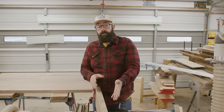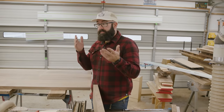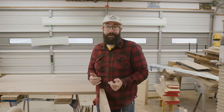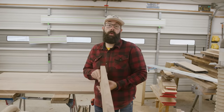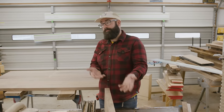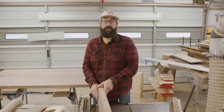This is something you need to factor in when you're designing your pieces and when you're ordering your material. I mean, we had 7 pieces of wood, and one of them went bad. So that's 1 in every 7 pieces of wood on average for this project have gone bad so far. So I would factor in at least 10 to 15% waste when you're ordering up your material. I do only need 6 boards, but because I ordered 7, we're gonna be all right. So I just wanted to talk about that real quick. These things do move, it happens. You just need to factor it into everything.